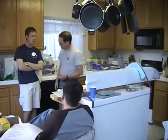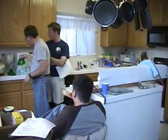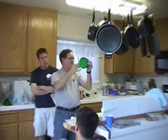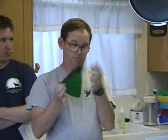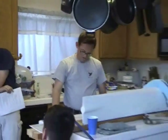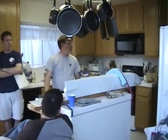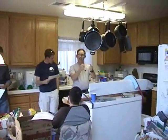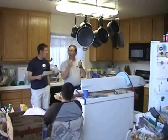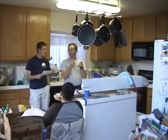Now, why do I care about the strength? This was the last one we did — it's not quite clear, it's got a little imperfections in here from the felt. This man tells me that's easy to polish out; I believe him, but he hasn't shown me how yet. And if you leave it stressed, that stress will lower the surface tension of the material. Also, solvents will further lower the surface tension, allowing it then to crack.